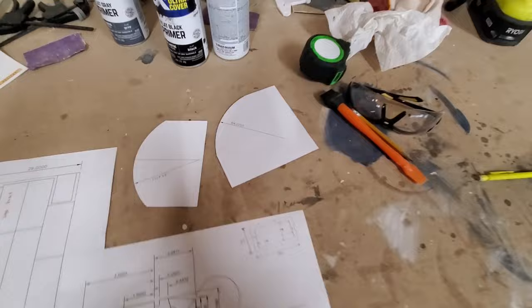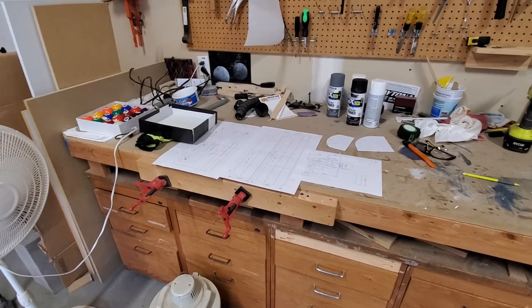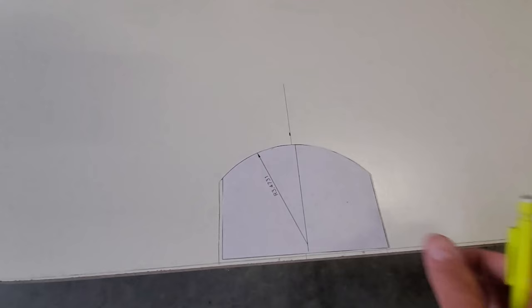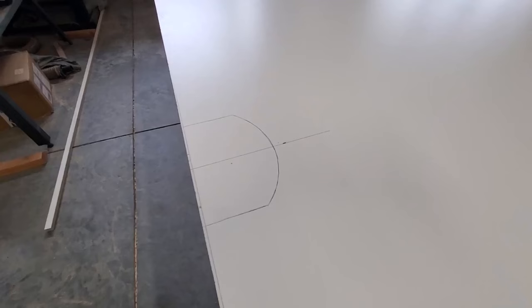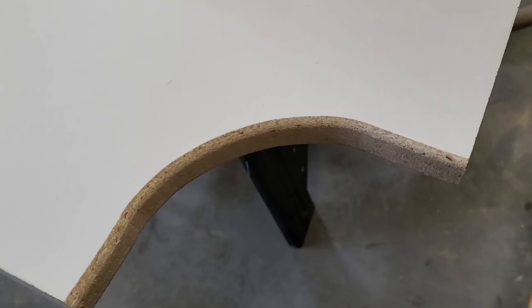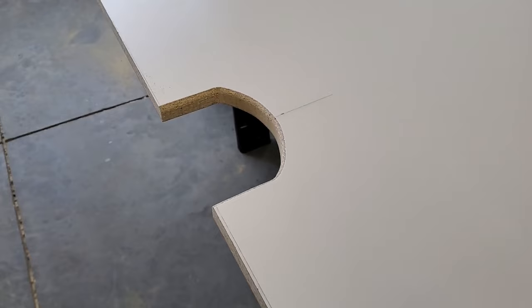It's all designed and drawn up on AutoCAD by myself, so there might be some slightly unorthodox methods for putting things together, but it should hopefully work out. Now that I've got my pockets marked out from my templates, it's time to cut them out. Pockets are all cut out — starting to resemble a pool table surface now. I went over the edges with a quarter-inch roundover bit so it's not so sharp and jagged, and the balls will roll in easier. Did that to all six pockets.